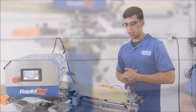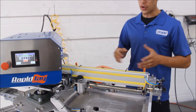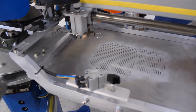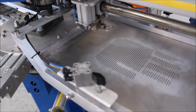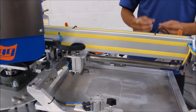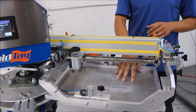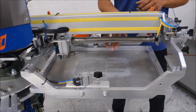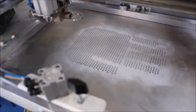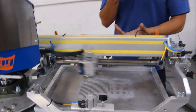This is the print head for the LP2XL. The squeegee head goes back and forth — this is customizable to go faster or slower. We have squeegee pressure adjustment here, so you're able to put more or less pressure. When it comes to dots, we have a very thin piece of aluminum with CNC-drilled holes. The point of this is to get the ink within the walls and have the squeegee pass over nice and smooth, creating a pressure that will push the ink onto the glove.